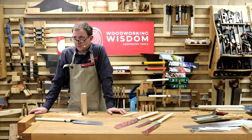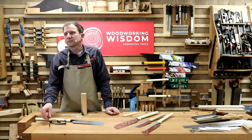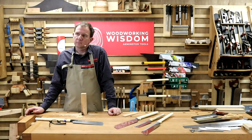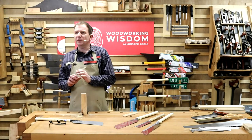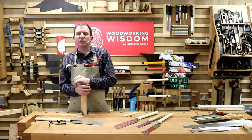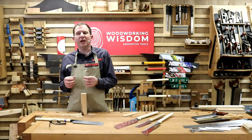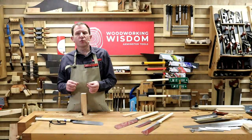Okay, so a couple of questions here, Jace. First one is from Fuller, and he's talking about there being two different hardening processes. He was asking, does one result in a better finish than the other for a longer life? Okay, so one of the things that they do for a Japanese saw, which is different, there's a technique now, which is obviously possibly quite new. Traditionally, a blacksmith would have made the old traditional saws. Each tooth would have been heat treated.